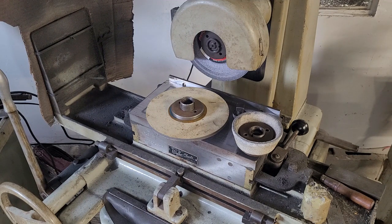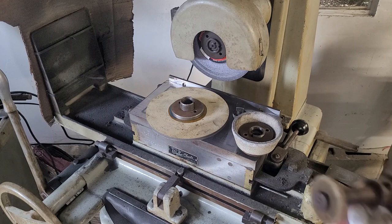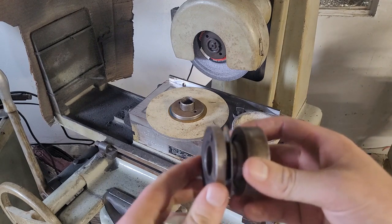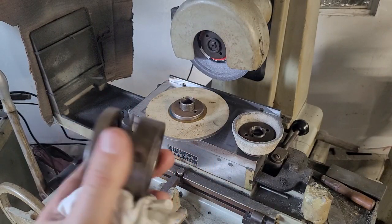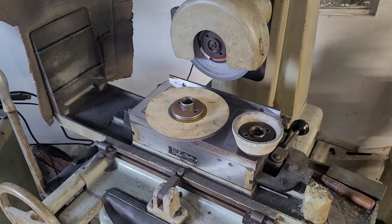I'm going to grab a couple more hardwoods — excuse me, a couple more wheels out of here. These are really specialized for tool and cutter grinding. These arbors will also go on the machine, so you can see how I can reach back into confined spaces. Some of these are missing parts, but this is really nice for grinding in confined spaces — these could also go on a tool post grinder, not necessarily a surface grinder. You can see what one of the non quick-change arbors looks like — these are hard to pop on and off. The quick-change ones have threads in here for the puller. I probably could put this on the lathe and single point some threads in there, but they're remarkably hard, so it's not practical to single point thread cut on these.